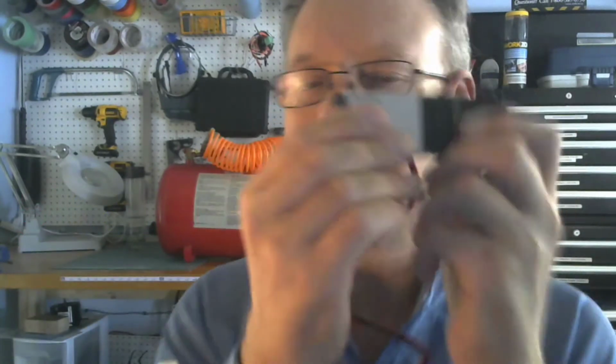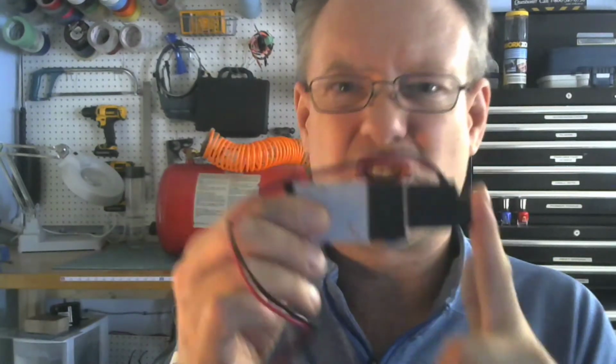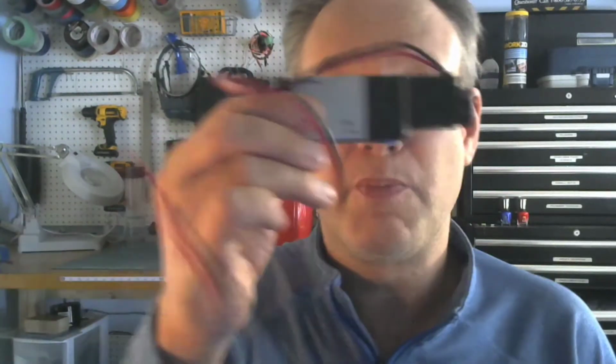So what this is, it's a spring return valve. When we looked at pure pneumatic systems, we had springs that actually activated the spool or changed the state of the spool inside the valve, and we also had pilots and mechanical things, push buttons and stuff. In this case, I've got a spring on one side. On the other side, I've got a solenoid. It's actually physically pushing the spool inside.